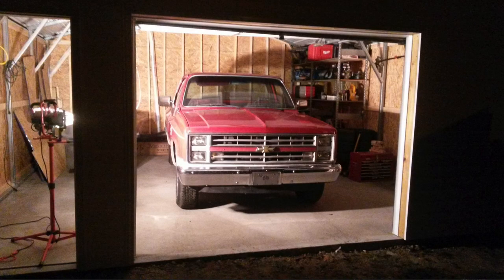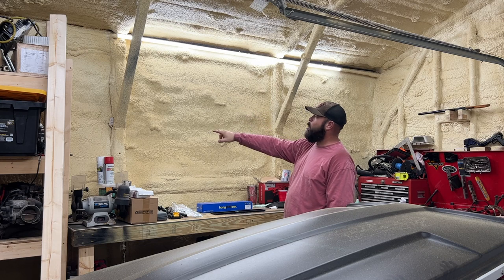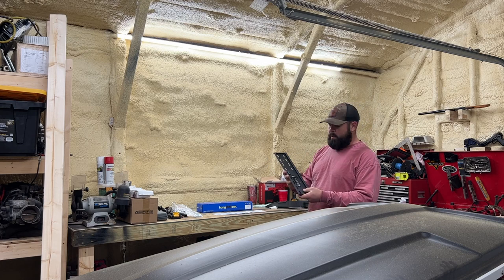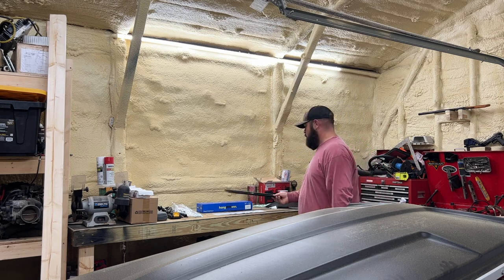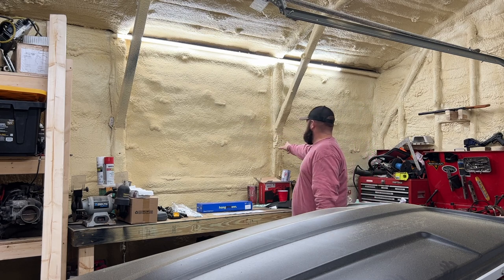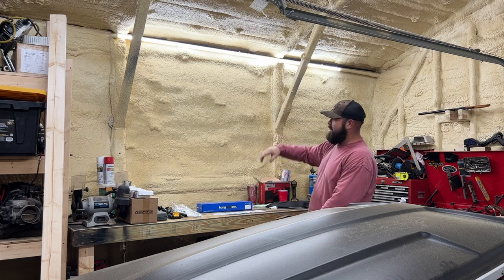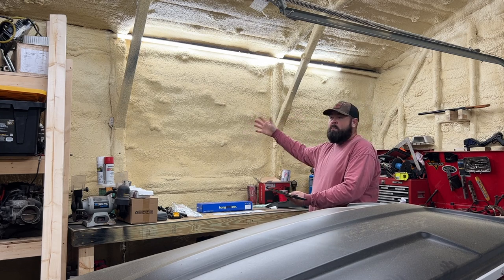Behind these right here and the spray foam, you've got your metal uprights and they're five feet apart. I got a 50 inch TV from Amazon — I'll place a link to it in the description below. It's cheap. And I got a cheap bracket too — I'll place a link to that in the description below. The bracket is going to fit a single two by four. So I'm going to place a two by four across from this metal beam here to that metal beam, level it up, attach the TV wall bracket, and hang the TV. It should be pretty simple.